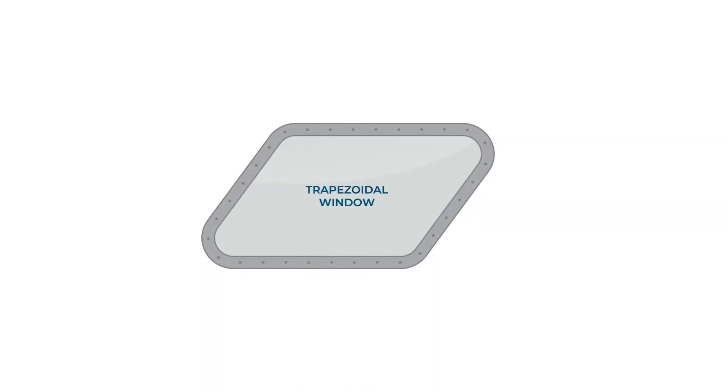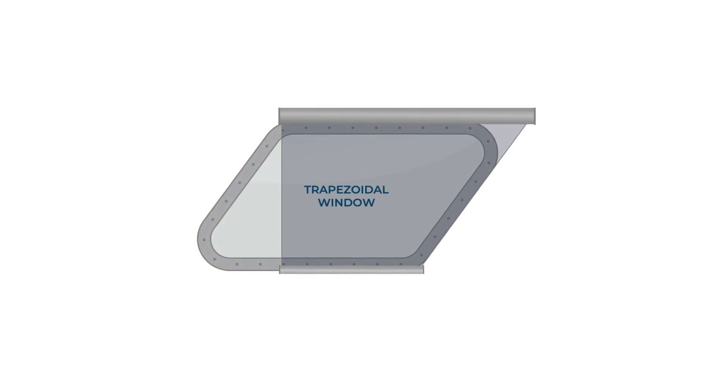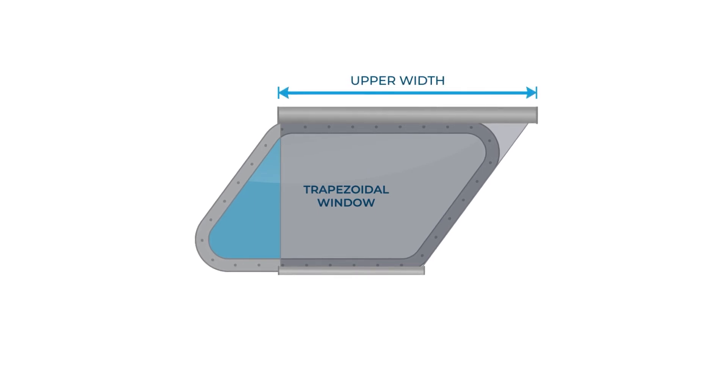Another common window on board ships and boats are trapezoidal windows. We offer two solutions for trapezoidal windows to provide partial or full coverage. Solution one is to install a standard tapered solar screen onto the window, which will cover a good portion of the glass. This will, however, leave a small triangle of uncovered glass in the corner. This triangle can remain uncovered, or alternatively, we can provide a matching adhesive solar film for this small area to gain 100% coverage. To measure for this option, you will need A, the upper width; B, the lower width; and C, the height.